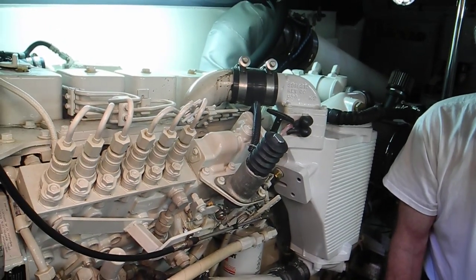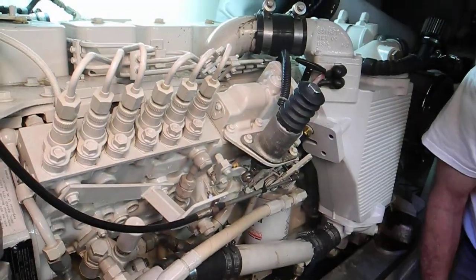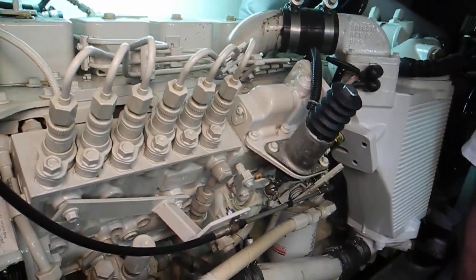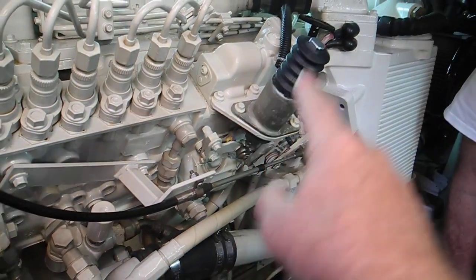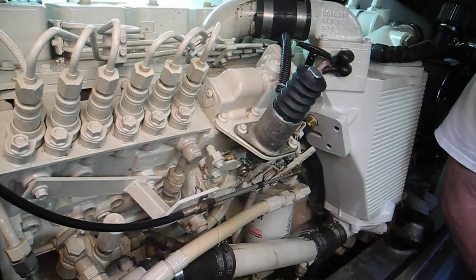We've got the buzzer because there's no more oil pressure, so it can turn off that switch, which turns off the power to the engine control panel. This is the solenoid — it's an electromagnet — and when you turn it off with the key or the button upstairs, it will electrically turn it off.